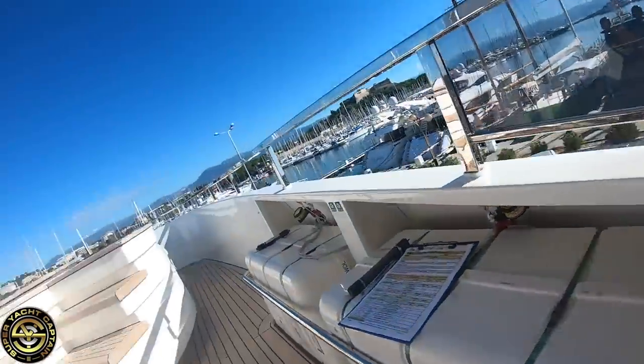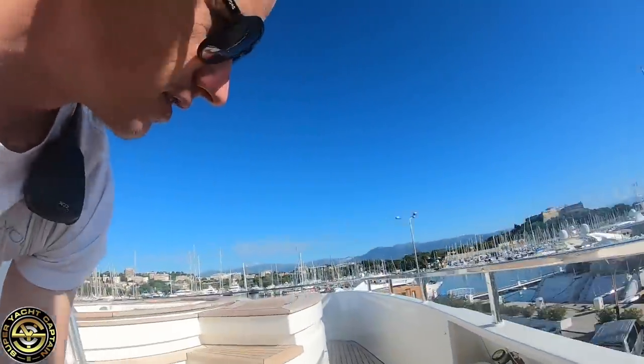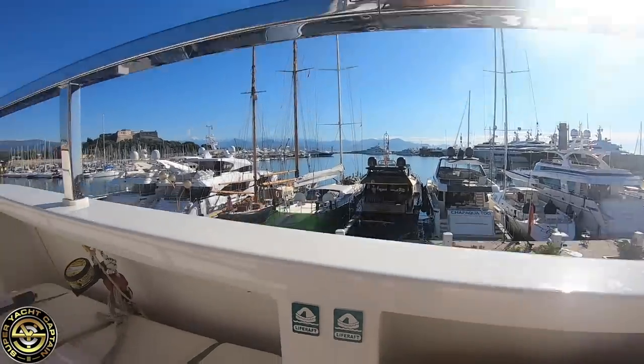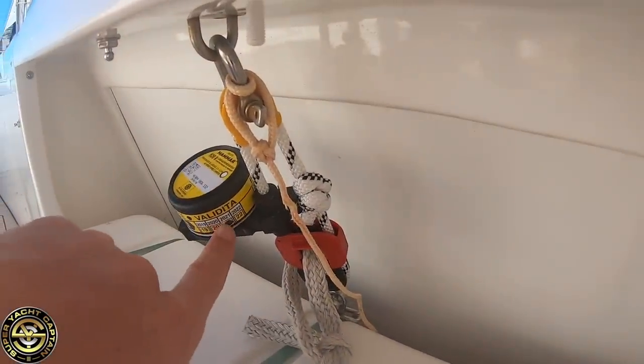When doing these monthly inspections you're basically doing a visual inspection on the general condition of the raft and the hydrostatic release units, making sure the areas are all clear — nothing is blocking the exit of the raft in case of emergency. There must also be clear signage, as you can see here. Both life rafts are good, in date and valid until 2021.